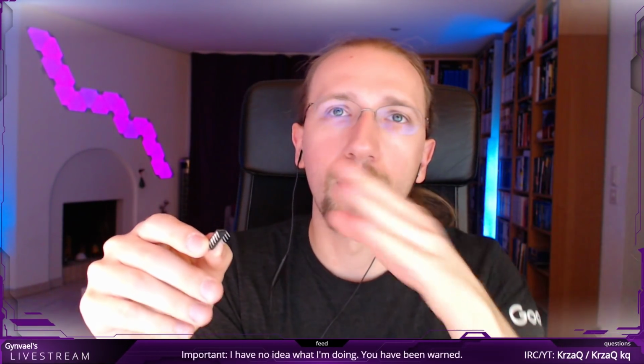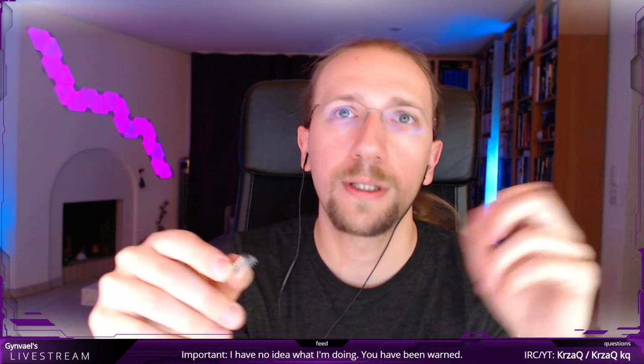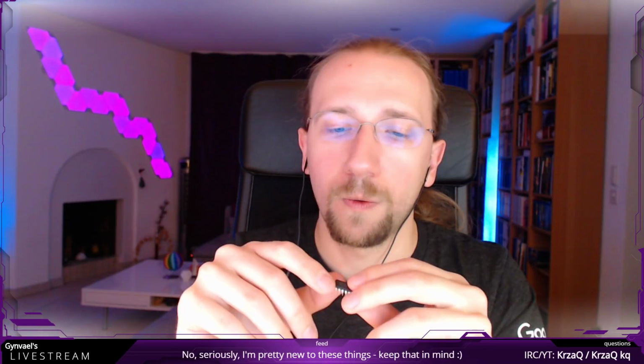Now, I'm not going to use one of these, I'm going to use 3 of these, because a cool thing about the shift register is that it usually has another input, which in assembler, if you're into assembly, would be called the carry flag, which is the bit which is pushed out of a register if you do a shift operation on it. And in this case, what that means is you can basically pair it up with another 1 and then another 2 in serial chips like this, and not adding any additional output pin usage on the Arduino, we suddenly will get 24 outputs on this. And we do not really need 24 outputs, we need 20 for the address, but that's fine. We will just not connect or ground the remaining ones.